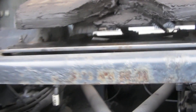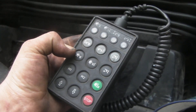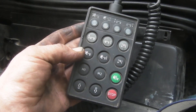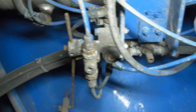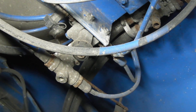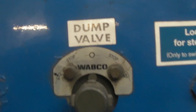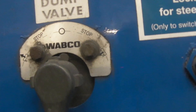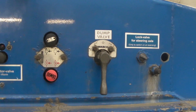You can just about see the A-frame on the DAF rear axle. There are certain things that are very common in motor vehicle engineering whether they're big or small. ECAS like this - some of you might have seen this on the retrofit Land Rover kit - this is in a DAF truck. This one is actually fully manual with no electronics in it, and it just depends on the valve itself to keep the airbags at a certain level. It's got a reaction rod attached to the axle, and basically it gets its control from here, which keeps the body at a certain level from the axle. D2s can have air - any Land Rover can have air. This is a mechanical raise, lower, or level valve, which is pretty handy to know because I'm thinking of doing this on the D2 project - having airbags but with manual control.